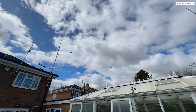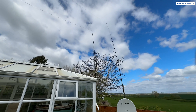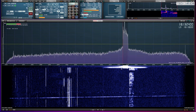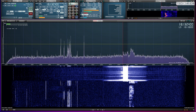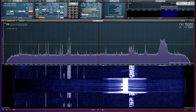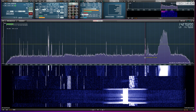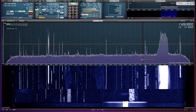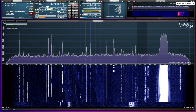On the 40 meter band I had a QSO with someone from Finland. Switching between the shorter antenna with the remote tuner and my end-fed half-wave antenna, I was surprised to be told the remote tuner antenna was around one S-point stronger. I did see an increase on receive as well. I also performed some receive tests switching between antennas and recorded the SDR software — unfortunately band conditions were not great, but that may have actually helped when performing a comparison between two antennas.